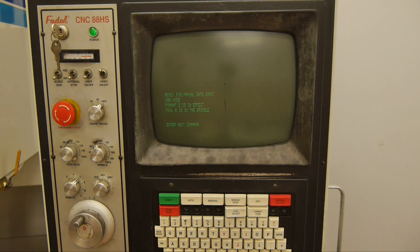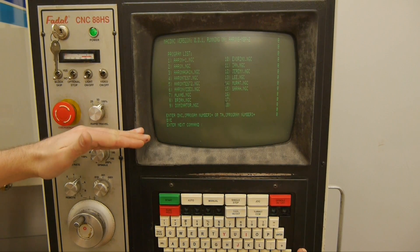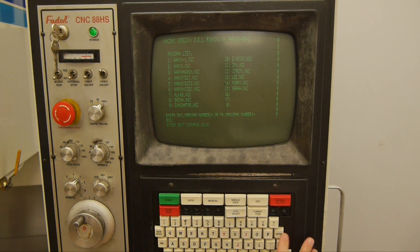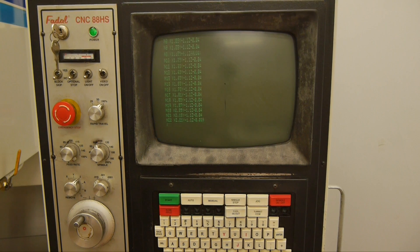Now that we've got the paper set up, we need to transfer the program onto the machine. To do that we're going to type CD8, which tells it to change to listening on the serial port at 9600 baud. Then we're going to type DIR+ which talks to the software I wrote and gives a listing of all of the files on my laptop. The file we want is number 6, so we say TA comma 6 and hit plus.